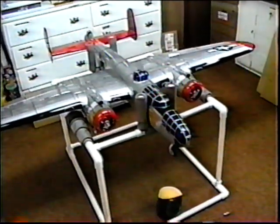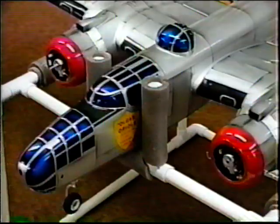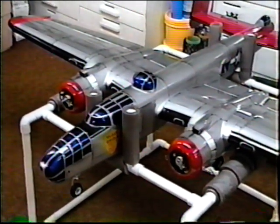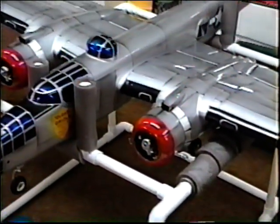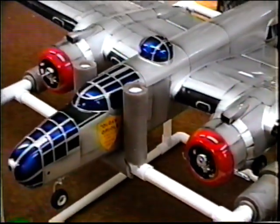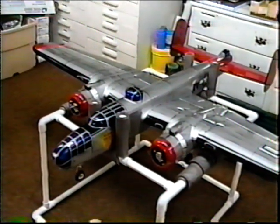So after reviewing the video that we took the last couple of days, I wanted to make two modifications today. I want to take some pitch out of the prop, very little, maybe the thickness of a piece of paper, because we're using full 11-inch props now. These headers, again, to show the logic here, allow the motors to run at a more powerful setting. We've added head gaskets. Richard Oliver is hopefully going to be able to get us some heads with a little bit lower compression, just so we have both in inventory.